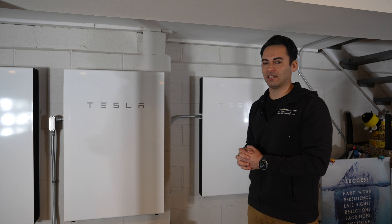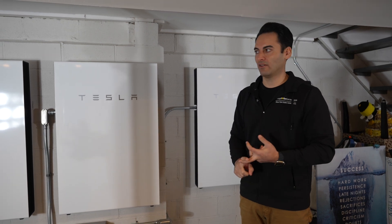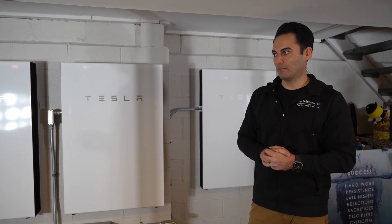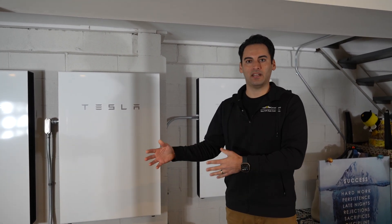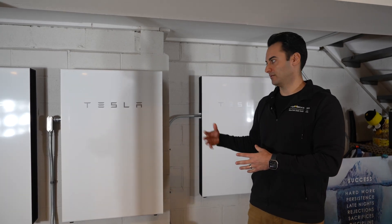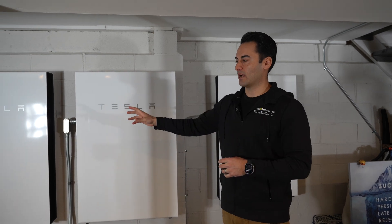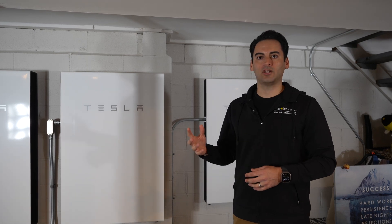That's up to every homeowner and what they're going through. In our situation, with heat pumps, electric vehicle charging, and everything we have going on, it makes sense to get that additional 13.5 kilowatt hours of storage. Outages usually last longer than a couple hours, so having that backup storage to go longer term is important. You can get more out of your Powerwalls through load management — shutting down some loads in your panel during a blackout to make your system last longer. I hope this video was helpful in going through some tips of things to know when adding a Powerwall to your system.